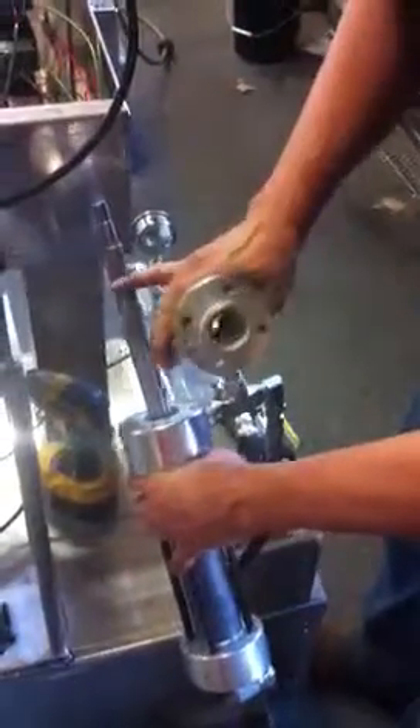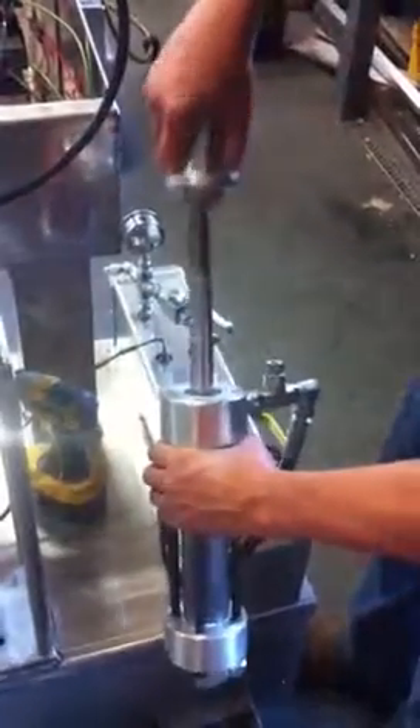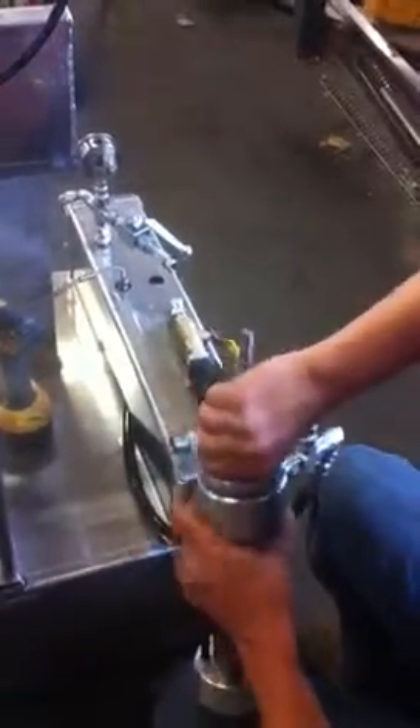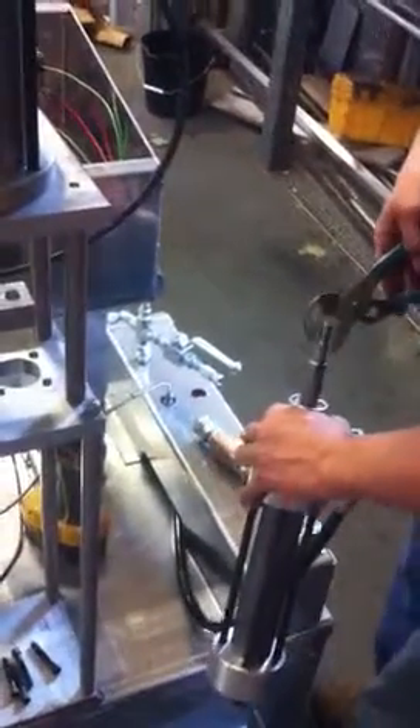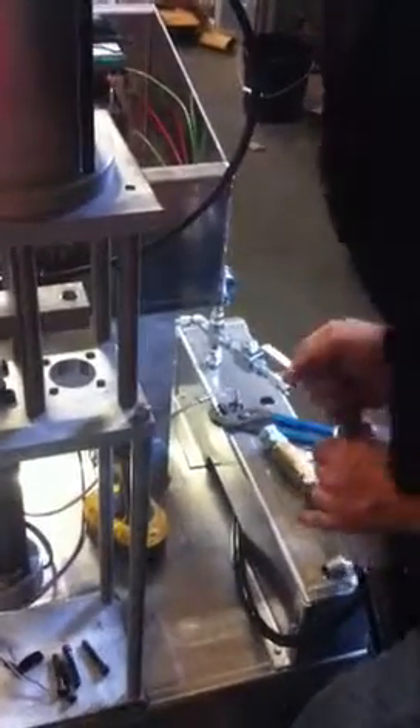Be careful when you put that back together — it has a taper in the shaft, and we want to be careful of that high pressure seal. Turn that a little bit so we can seat that O-ring in there. Line up the holes here so your bolts will go in.